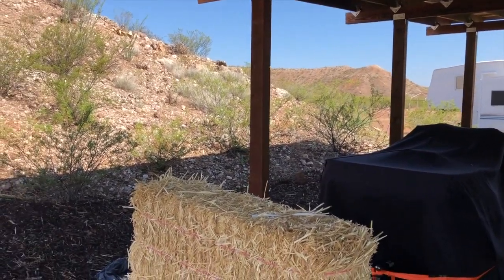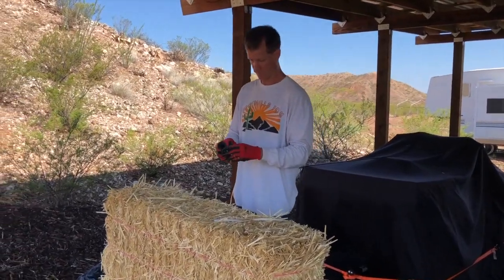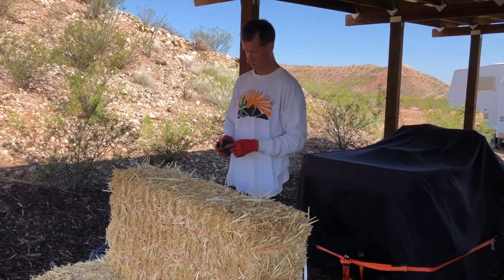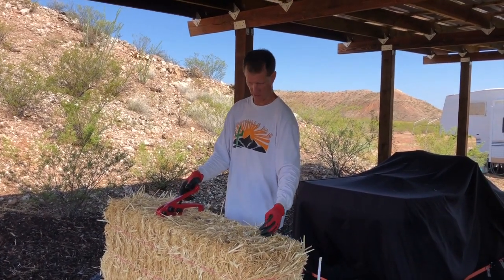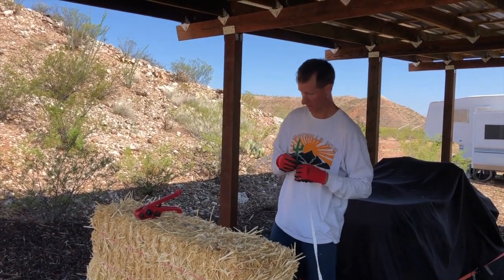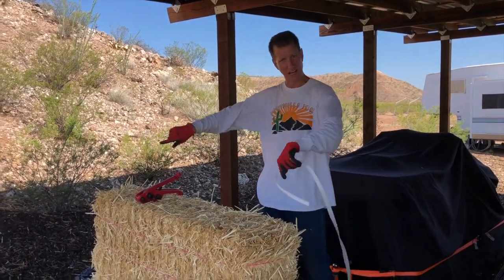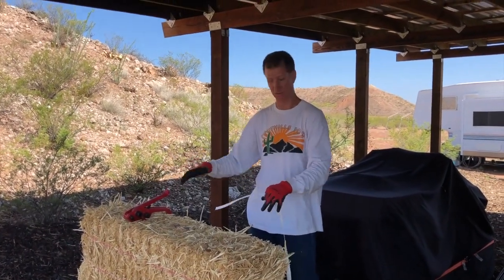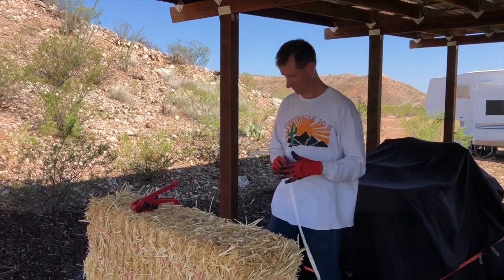You don't always need a full bale — we're going to need partial bales in some places like around doors and windows. That's why he's cutting these; they're going around the door area. We use buckles and a tensioner — or windlass — to take this strapping material. You get enough cord to push through the bale and go around both sides to make new ties. When you've tied your two new bales, you can cut the old strings and the two bales will come apart as two new bales that have already been strapped.